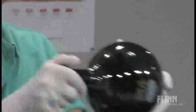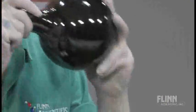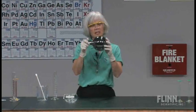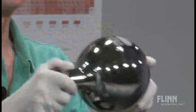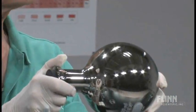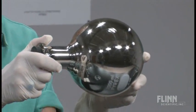I want to talk about mirrors in general. We all know that mirrors are expensive, and one of the reasons why is because of the silver. But it also depends on the quality of the glass. That's why if you have a mirror that is not done well or it's chipped off, you're going to want to take off all the silver and re-silver the mirror, because the glass itself is important.